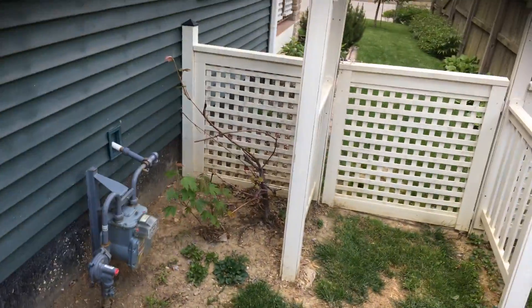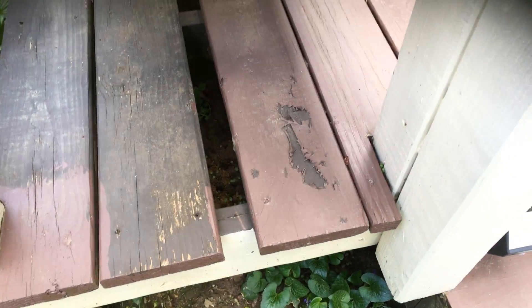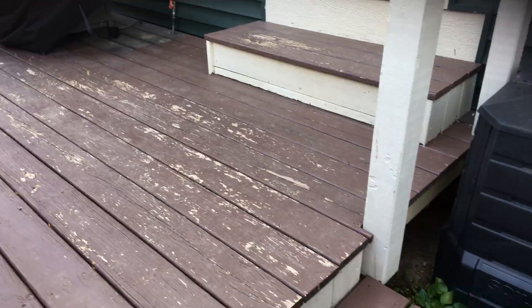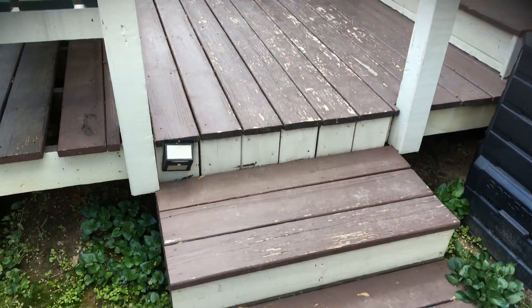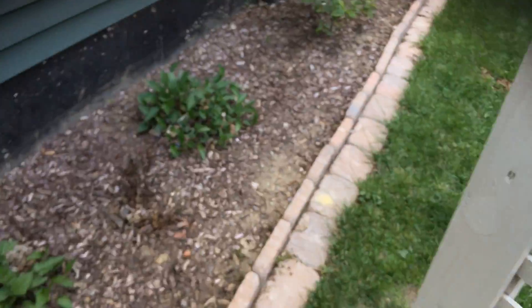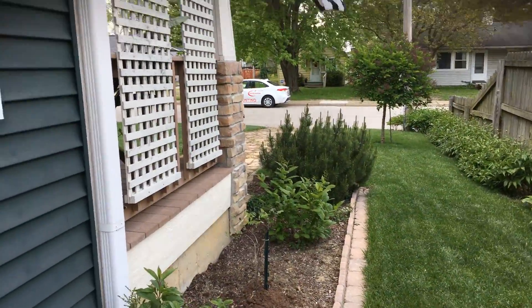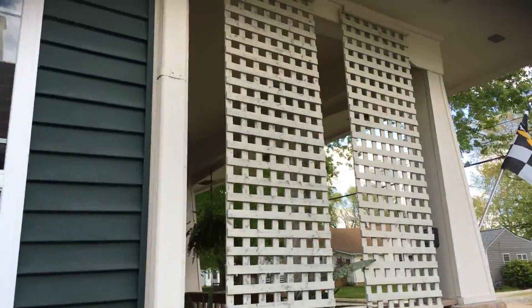This door is priced in with the house. For the floor here, we discussed scraping and priming with a peel-bond primer — sealing down the edges of anything we can't remove — and then using a solid stain over the primer. Solid stain will hold up better than paint in this application. Same thing with the bench: use a stain rather than a paint. That's pretty much the scope of work. If you have any questions, feel free to let me know — I'll get this quote worked up and have it over to you later today.